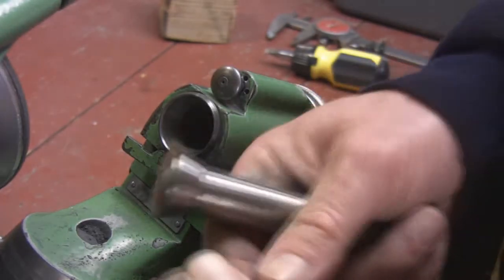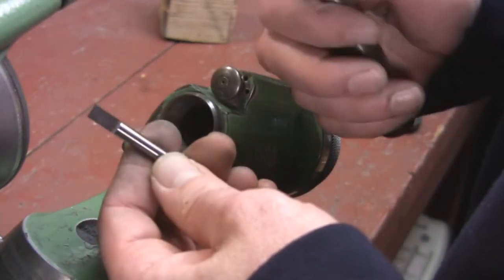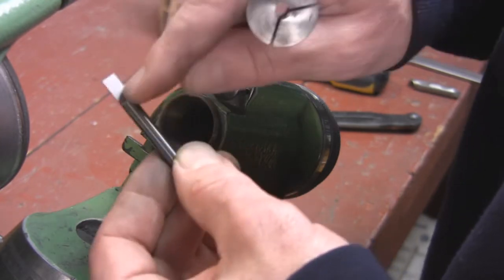In this video, we're actually going to start grinding a cutter. And this is a quarter inch piece of carbide cutter blank that has been split halfway through. And that is a common trait to all single lip cutters. They have to be split.